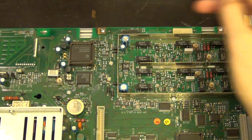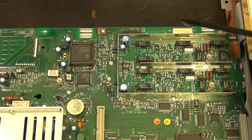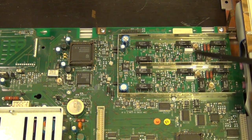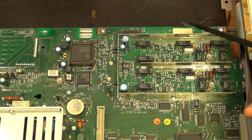If you were to add the several gigahertz expansion here, as I explained in a different video, that expansion just amplifies, limits, divides with a static divider, and then the divided signal will be within the counting range of this instrument once again, and then you're going to be able to basically measure high frequencies. That's how this one works.